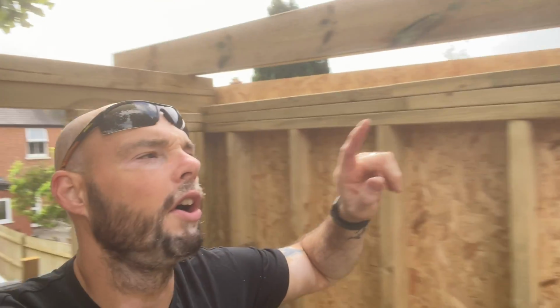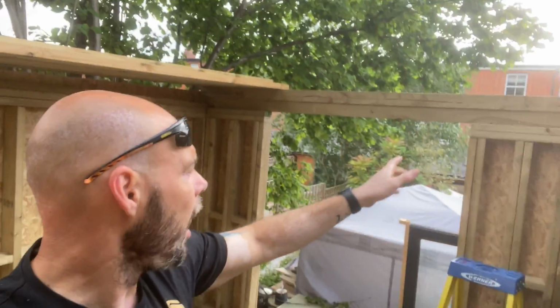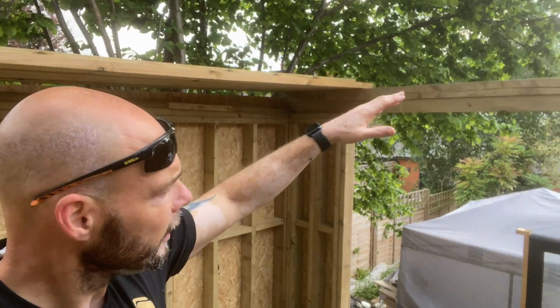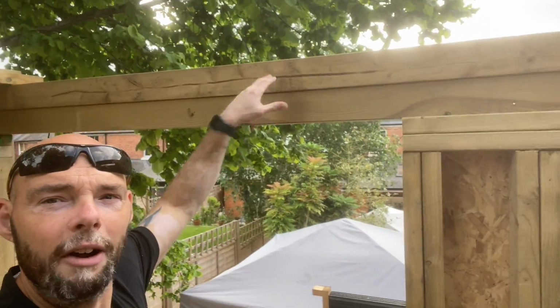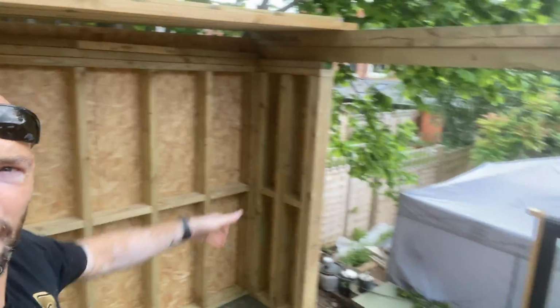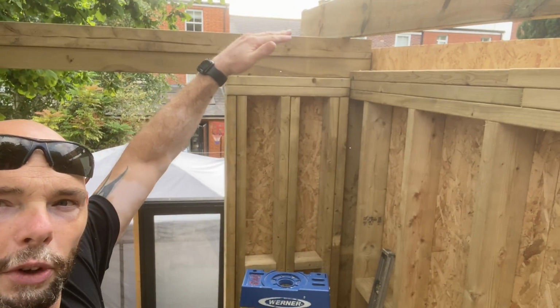Once I've got the joists up and on, and the OSB on and that kind of stuff, I will then put some jacks underneath here, which will support it. I will then raise it up very slightly, because they're adjustable, they're very handy. Whip these bad boys out, get the steel into the space, get it pivoted into the corner, lift up, a couple of us, put it over there, drop it in, and then just lower the roof down.